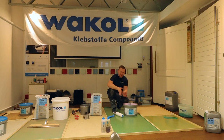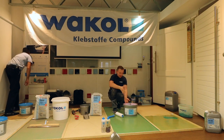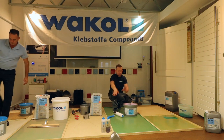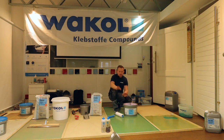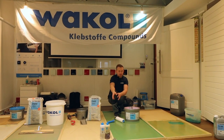Keep in mind: half an hour to 45 minutes of curing time, and consumption around 150 g/m² — it could be a little more depending on the surface. If you apply more, you just have to wait a little bit longer. It blocks up to 98% moisture in half an hour per coat, and then you can prepare the subfloor for leveling compound.